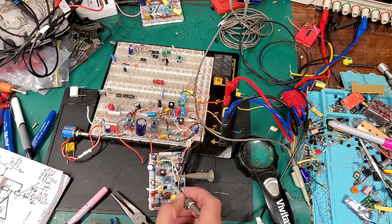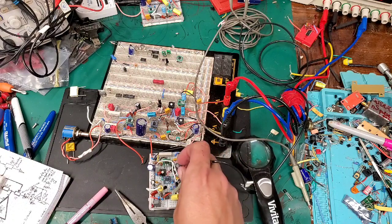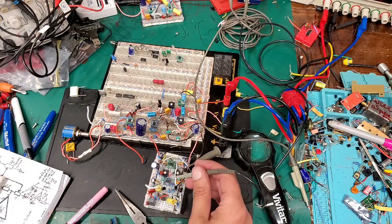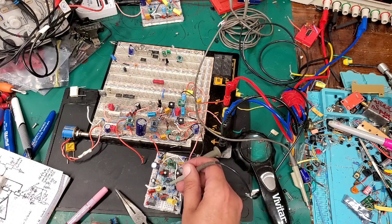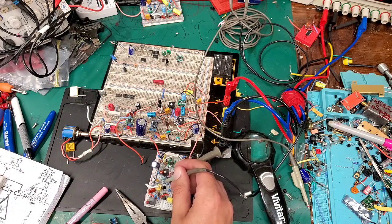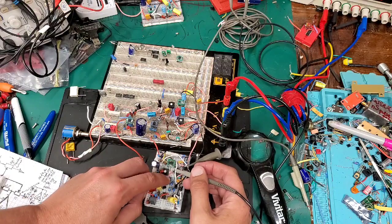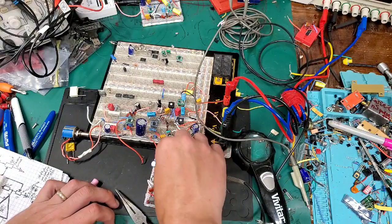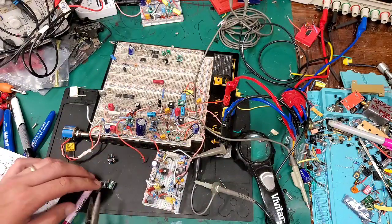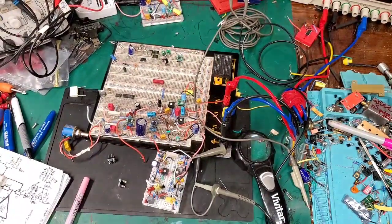All right, so that's getting juice. On his ground, check. Pin 3. Getting pulses. What about you? Are you the dead one? I think so. Nope. Let's try that again. Nope. Well, fixed. Now let's try putting them back one at a time. See which one makes it go to bed.